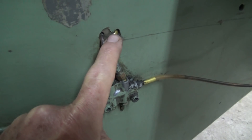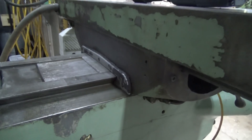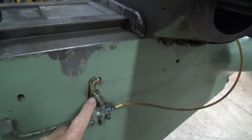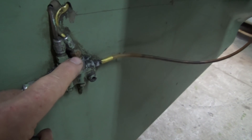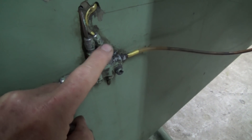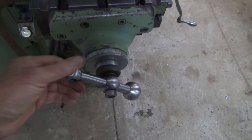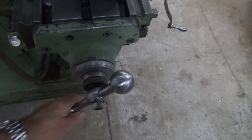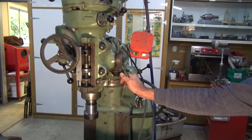That's going to mean a repair I don't even want to think about at this stage. The only way I can get at that pipe, I believe, is to remove the table and expose this section so I can get inside and see where that pipe goes. That's going to need some investigation — I'm not sure whether I'll need to get a new restrictor or a new coupling. Either way, that's going to be a difficult repair. The other thing I've been able to do is adjust the backlash, which is pretty good now — I'm getting about 0.2 millimetres backlash. It gets tighter toward the outboard end of the travel, but that's to be expected.